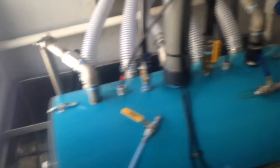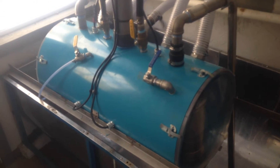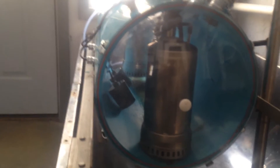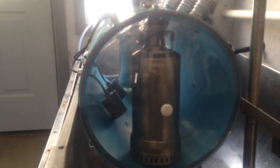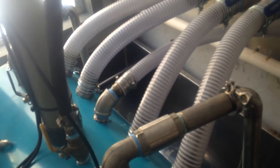This is a new releaser we just put in this summer, and it's all made by us — PVF Maple LLC, dealers of H2O Innovations products. This is a BHR tube sold through H2O Innovations. We got it as a blank tube and put the pumps in ourselves. We have two pumps capable of pumping about 50 to 60 gallons a minute without vacuum. It hasn't been tested under vacuum yet, but we know these pump types work. There are about 8,500 taps coming into this releaser.